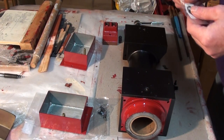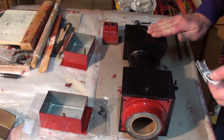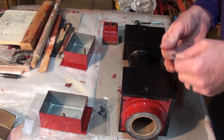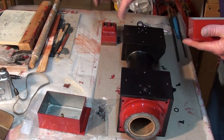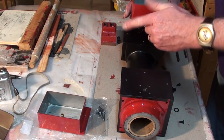After painting, the main axle oil boxes were fastened to the main axle bearing casting. O-rings are supplied to place between the casting and the oil box. There is a depression in the bearing casting on each side to locate the O-rings. The instructions show the correct orientation of the oil boxes to the bearing casting.